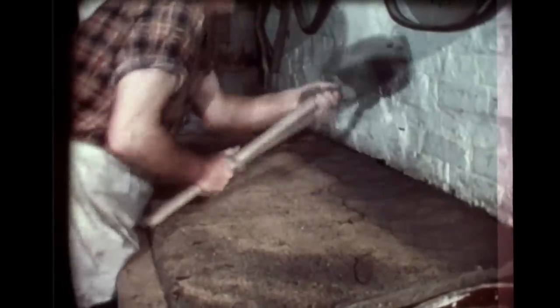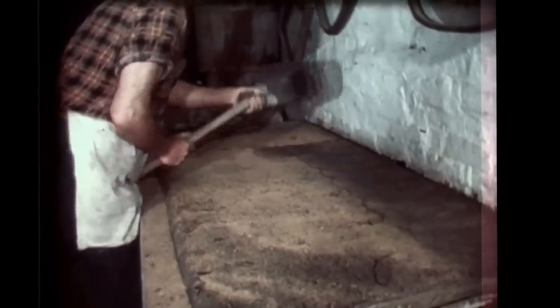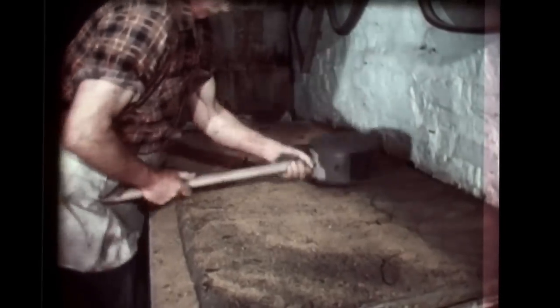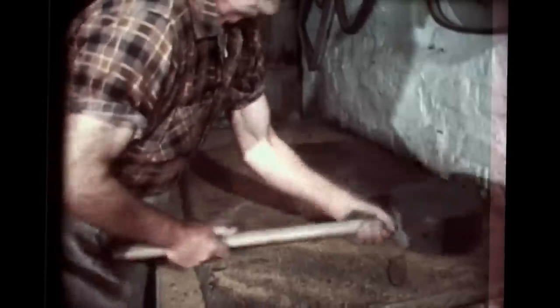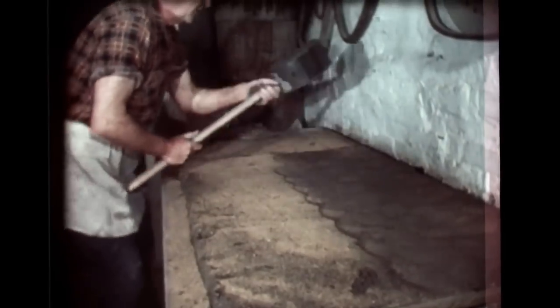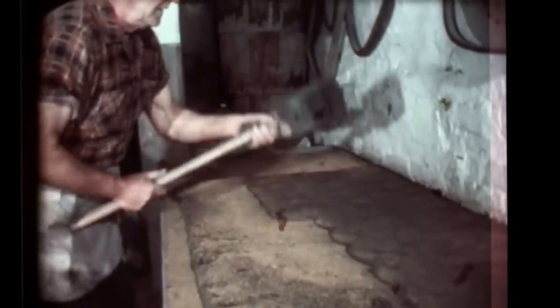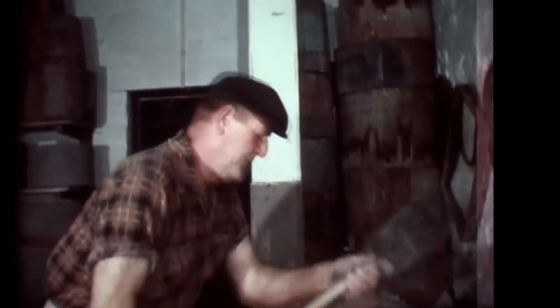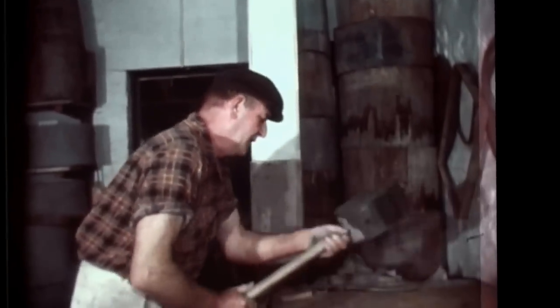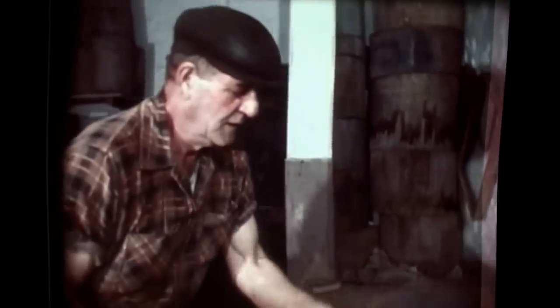Anyway, when you're moulding the frame in, you start from the back and as you're moulding, you pull downwards and pull sideways. Every part of the mould as you mould, you'll notice the mould goes over where you first started, until you get to the end of the frame — and then you know the frame is solid and those are the sides of your sagger.